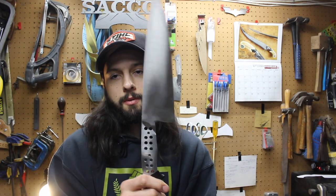That's looking pretty good right there — that's off my belt sander, off my rotary platen. That could be the end of it right there. But like I mentioned, there's one more step I like to do because I have a disc sander — I know I've mentioned it a million times, but it's such a helpful tool. I'm going to use my disc sander with a leather backing to help bring my grit up to about 400. The disc sander with the leather back really, really helps smooth out and blend that grit, so once I jump into hand sanding I can start right at 400, and honestly it's a breeze from there.